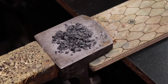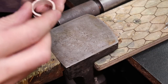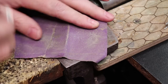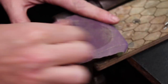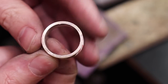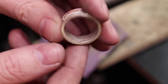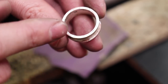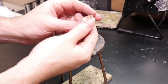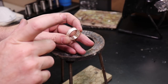I'll have links to all this in the description. Now that it's all cleaned up, I'm going to clean up the sides to make sure everything is going to be flush and there are no holes underneath any of the solder points. I'm going to use some 220 grit sandpaper and just a little bit of water. There are still some gaps and some parts that are just a little too far down — that would require too much sanding and you'd lose a bunch of material. So I'm going to add in some more solder, place it over those points and flood them, and then grind it down using sandpaper.